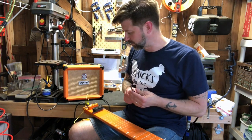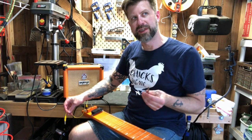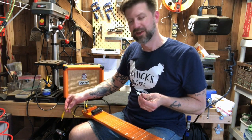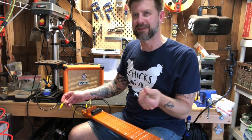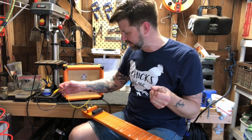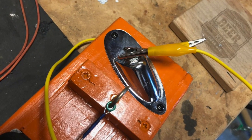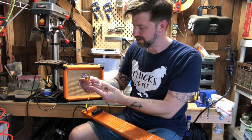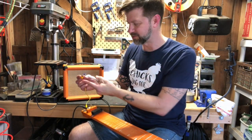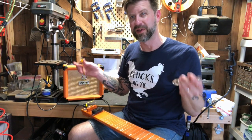Okay, let me show you guys something real quick. So if I do this, hopefully you can pick up, there's a lot of hum happening there. And that's probably an indicator of a bad ground. Maybe I'll do another video about exactly how you fix this, but I can show you how to diagnose it real quick. Take an alligator clip here, clip it onto your jack plate, and then touch it. And now hopefully you can hear that on the camera, but what happens is when I touch it, that hum pretty much goes away. And that tells me that I don't have a good ground.